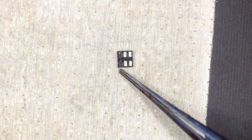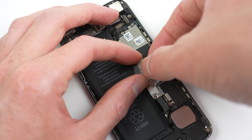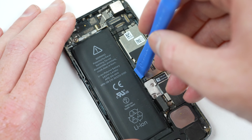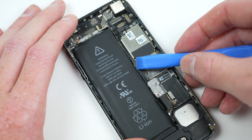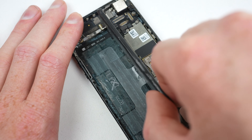However, we aren't able to reuse this one as two of its solder pads are missing. At this point, you may also be wondering how does pry damage occur? Well, it's caused by improper removal of the battery. Often the removal tabs break and people try prying the battery out by wedging their tool against the logic board, thinking if the tab was there, it must be okay. However, what happens is they knock off tiny components like the ones we discovered earlier.